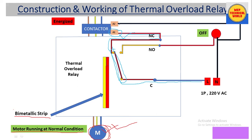The contactor is already getting neutral from the other side, so the contactor gets energized. The contactor allows the main power from its input terminal to its output terminal, which is given to the thermal overload relay and then to the motor. In this condition, the indicator will be off, because the motor is running normally — the NO contact is open, so the indicator gets no power.